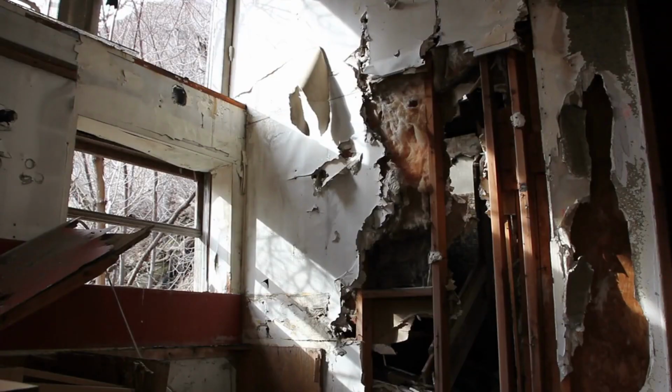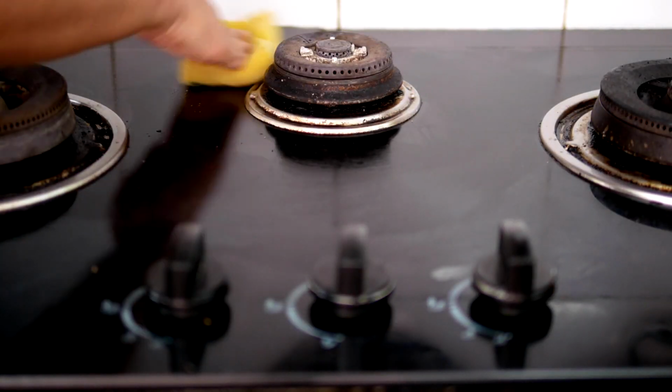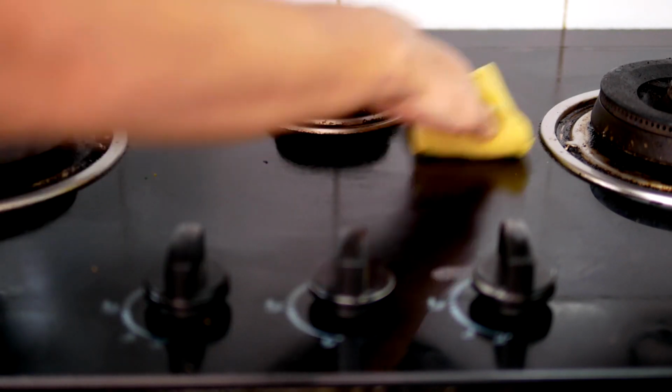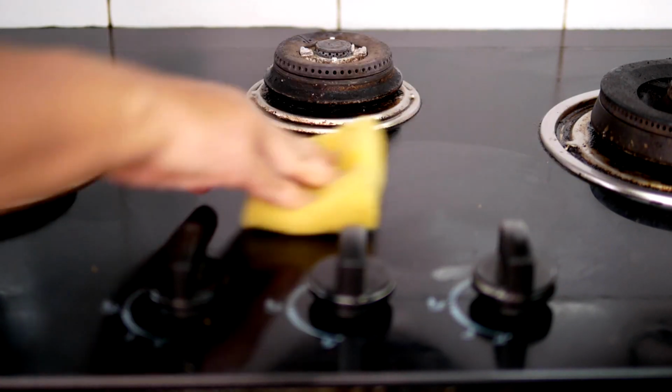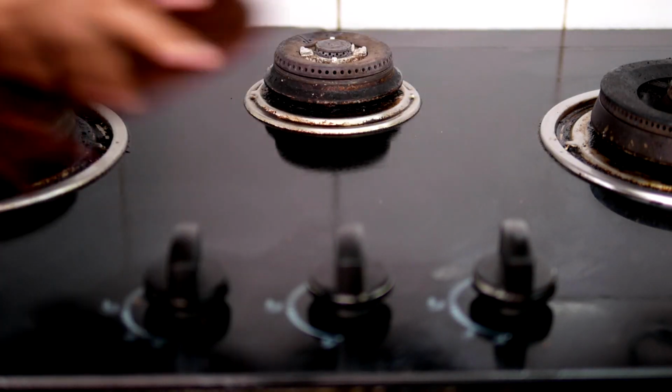One of the biggest mistakes people make with fireplace firebox rusting is ignoring it until the damage gets out of hand, which makes repairs way more expensive and complicated. Fix this by inspecting your firebox at least twice a year and tackling small rust spots right away with cleaning and high-temperature paint. Another common issue is using regular paint or household cleaners on the firebox, which don't handle heat well and can peel or cause toxic fumes. Always choose products made for high heat.